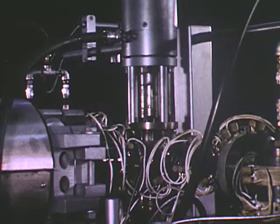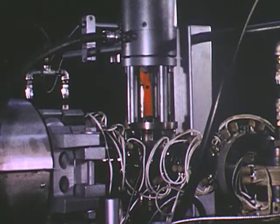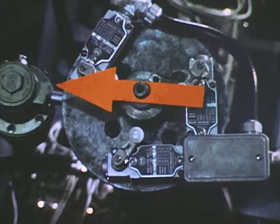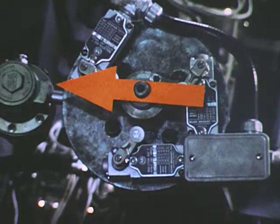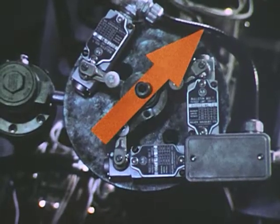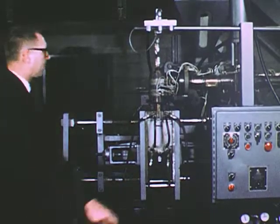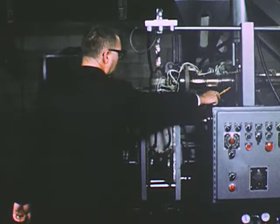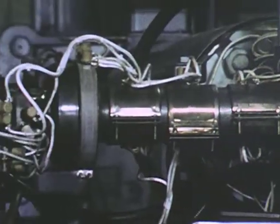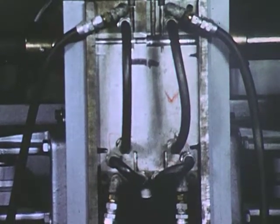The actuator assembly demonstrates the action of the rotary valve. When the valve is centered and both of the ports to the manifold are blocked, no plastic materials can flow through the valve, and any extrusion that takes place forces the screw to the rear. Now the rotary actuator turns and the left port into the crosshead is open. The screw is reciprocated forward and material surges through the valve and manifold to the crosshead. To maintain uniform flow, an additional valve is placed in each of the crossheads. Material flows through the second valve and around the mandrel to the tips and die at the rate of 1,200 pounds per hour — one pound in three seconds with this team.